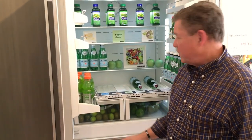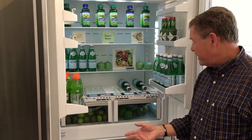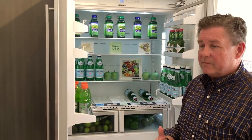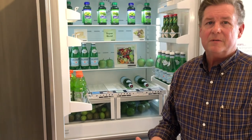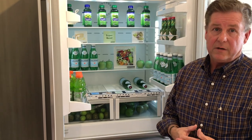The other setting is Dry Safe, which you'll notice has symbols for fish, meat, and poultry. We get a colder temperature with less moisture. Cheese can last up to 100 days. Meats, we're talking about seven days before you need to freeze them. Fish, maybe 24 to 72 hours before you want to move them to the freezer if you're not going to consume them. The idea is that you can bring items home from the grocery store or wholesale clubs and don't have to freeze immediately — store them in these colder environments and do it tomorrow.